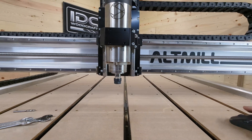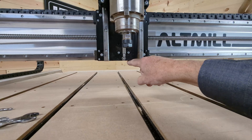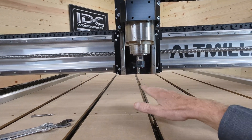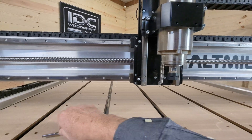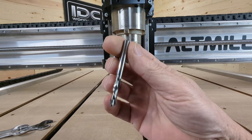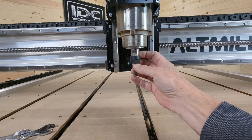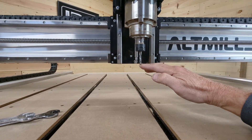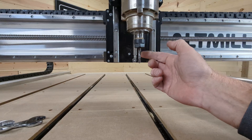I'm going to move my spindle all the way up — we have about an inch to an inch and a half here, and the spindle is mounted about halfway in the bracket. I want to take the spindle all the way down and make sure I get the max stroke. The reason I put the spindle up this high is because when we put a router bit in, we generally have an average length sticking out. Most often we are using these end mills right here — they have a one-inch depth of cut. I'll give it a little tighten one-handed and look at it along this plane so that the router bit is in at the proper depth, meaning the shank is up in it as far as it should be.